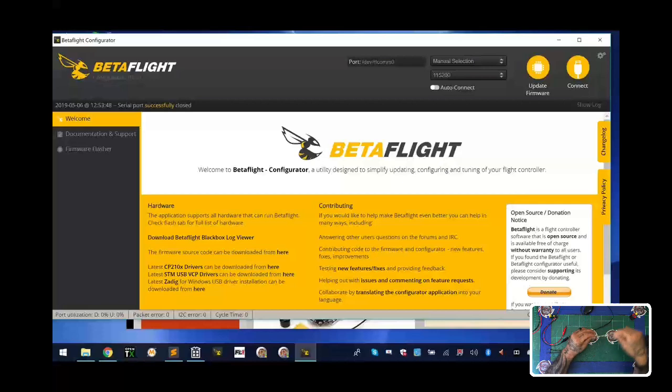If you're not going to use PPM, you can just go ahead and remove the yellow wire to limit what you're using. Very gently lift the last tab that has the yellow wire in it and try to remove the yellow wire altogether. Be very careful not to break the tab, because you want to be able to reuse it. There we go — we'll leave the wire intact and set it aside. You can always insert it back in. Press the tab back down so we can go ahead and insert this back into the receiver.